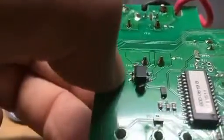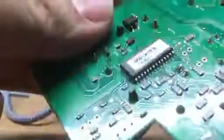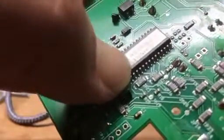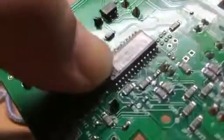But at the same time, for some reason, they really bulked up on the iron here. Not certain what the ratio is here, but I'm gonna go with probably a 10 to 1. That'd give us 12 VDC on the backside here, roughly coming out this side of the bridge rectifier. Then we have another IC here, which I'm going to guess is probably some sort of, not an ASIC, but probably something programmable. Usually they'll do this thing where they've got a label on top with a firmware version on top of a programmable IC like an Atmega or a PIC or, you know, usual microcontroller suspects.